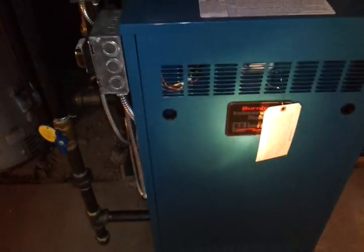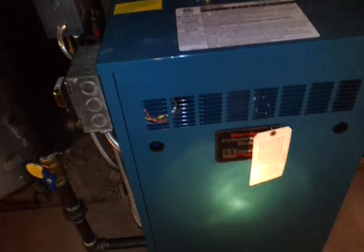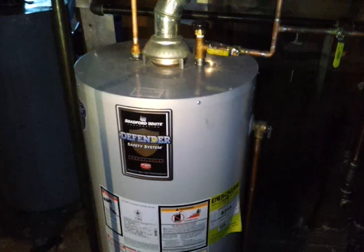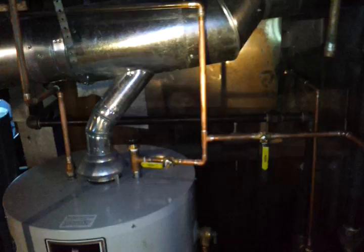Here's our transformer. A few years ago I put the same boiler right next to it over here. However, the new boiler has been updated — instead of having a standing pilot, it now has electronic ignition. This is also part of this project to install this water heater. It's a 50 gallon short and it was really a tight installation. That's eight inch flue pipe here and that's six inch directly into the chimney for the heating boiler.